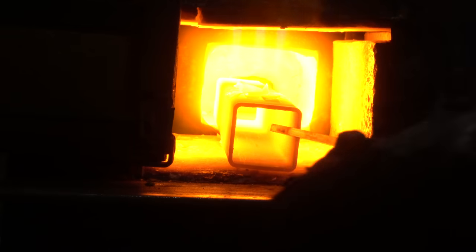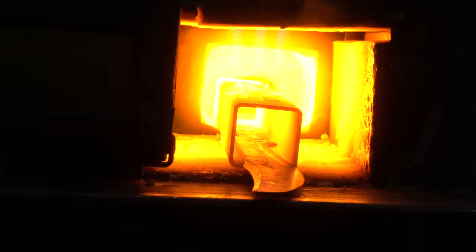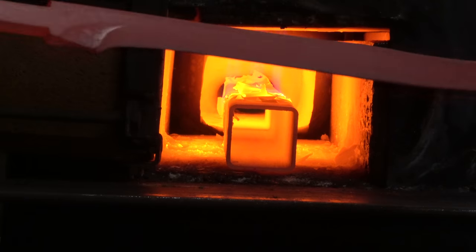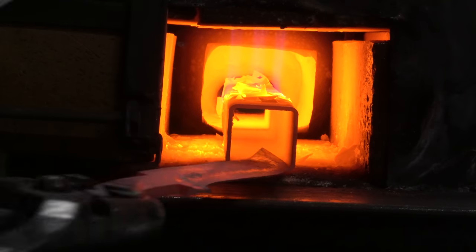This was the very first normalization cycle and I had the forges way too hot. I had to keep moving the blade around just to make sure it didn't overheat in one section. I was terrified I was gonna melt the copper out of this thing, which would have ruined all the work I put in so far — that's why I was constantly checking it.